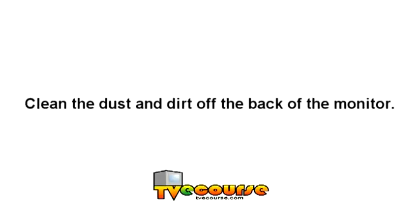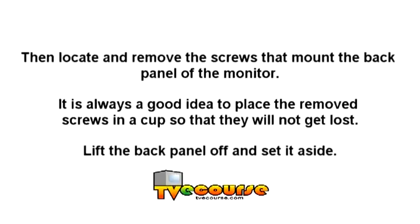Clean the dust and dirt off the back of the monitor. Then locate and remove the screws that mount the back panel of the monitor. It is always a good idea to place the removed screws in a cup so they will not get lost. Lift the back panel off and set it aside.